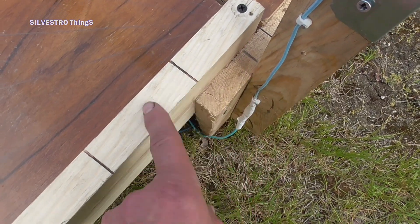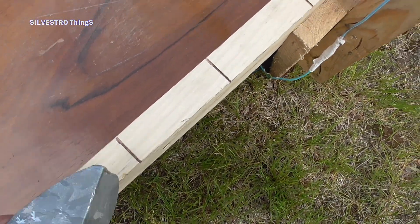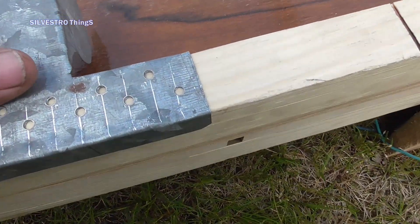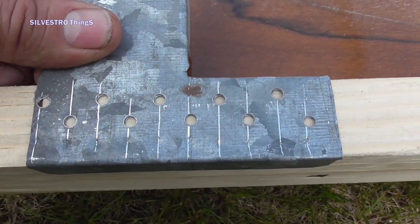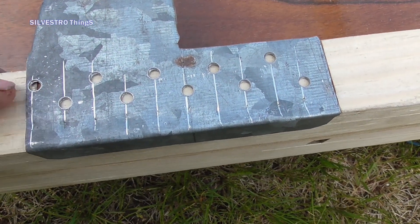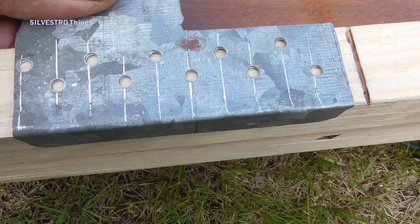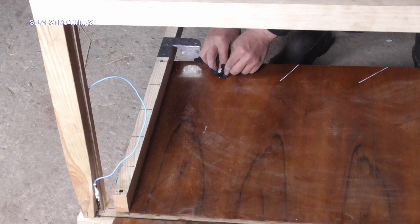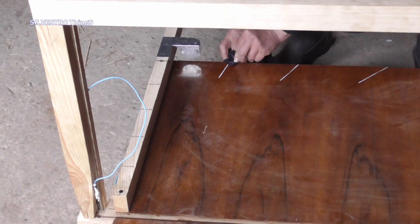The appropriate repeatable length and angle of the cut is ensured by a wooden locating bar with marks every 10 cm made with an angle grinder, and an easily movable stop with a 10 cm ruler. On the tabletop, marks were made for the cutting line at an angle of every 15 degrees by cutting grooves with a friction disc and filling them with silicone.